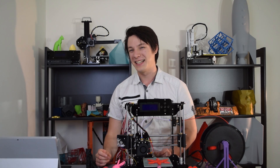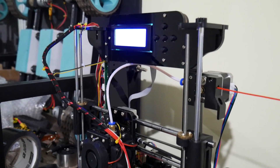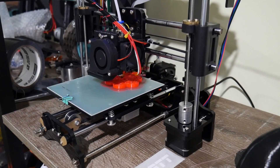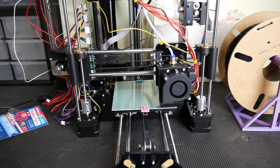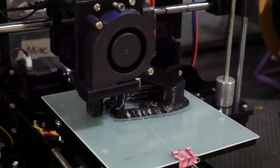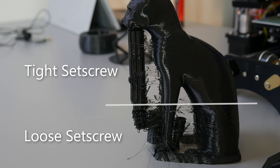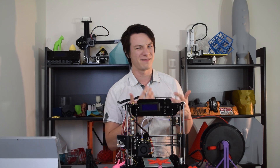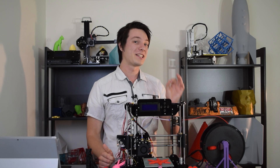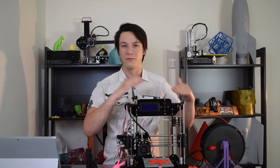Getting good 3D prints from the Start definitely takes some trial and error. The design really needs to be placed on a sturdy level surface and never moved, otherwise your carefully set bed level will completely change. This might have something to do with the total lack of frame rigidity — the correct word here is torsion. One reason prints came out terrible was my fault: the set screw on the Z-axis pulley was slightly loose, causing some free movement. However, I was not impressed by the incorrectly sized idler bearing for the Z-axis on one side — it was very large and meant the belt was being forced out of alignment. I replaced it with a smaller idler bearing, which works better, but ideally both sides should have been exactly the same size to avoid weird misalignment.